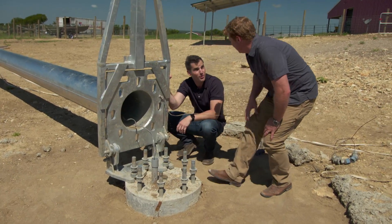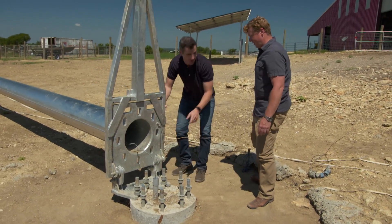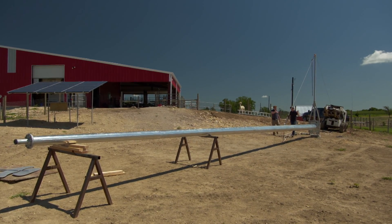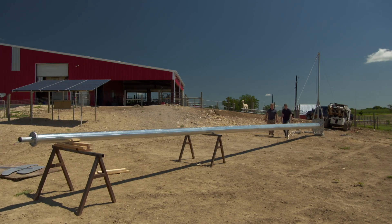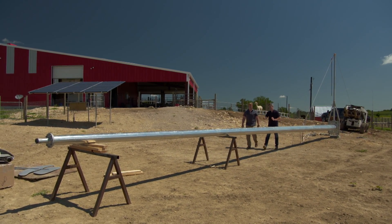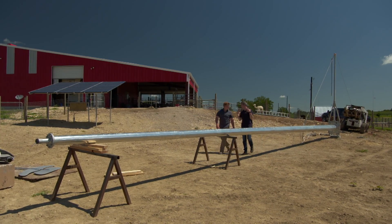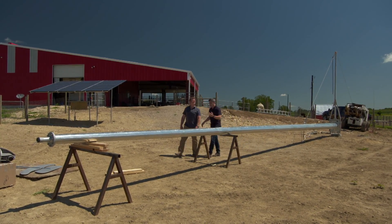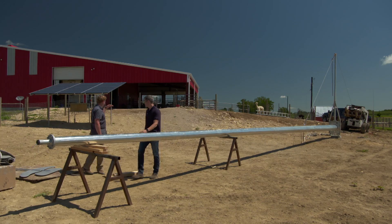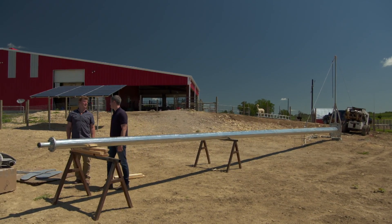So 1.5 kilowatt wind turbine — it's feeding the power down here through that conduit, ultimately to the inverter. We've got 3 kilowatts of solar and about half as much coming out of the wind. We've got a 60-foot pole, press fit together in 4 separate sections. With wind, it's all about wind velocity — the higher you go, the more power that's available. I'd like to see a 60-foot pole as well as something up on a hill, because the wind is really blowing up there.